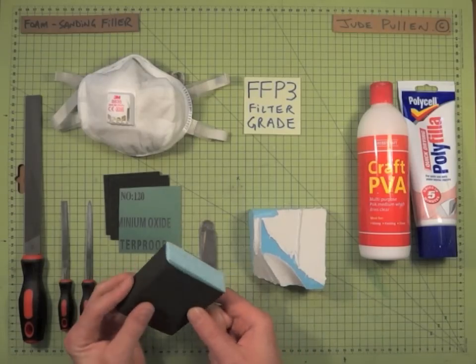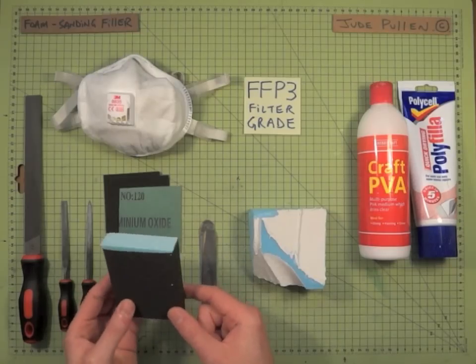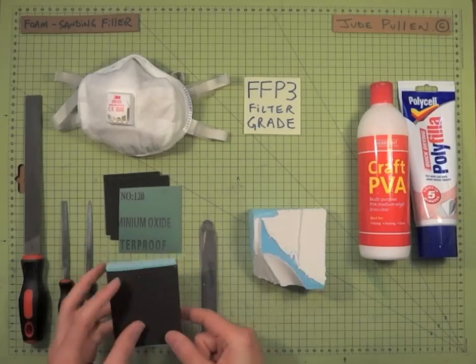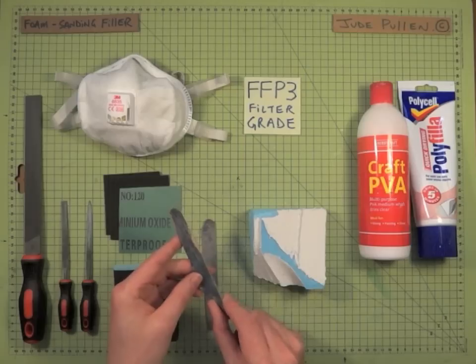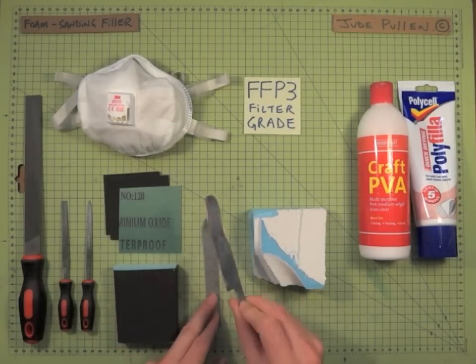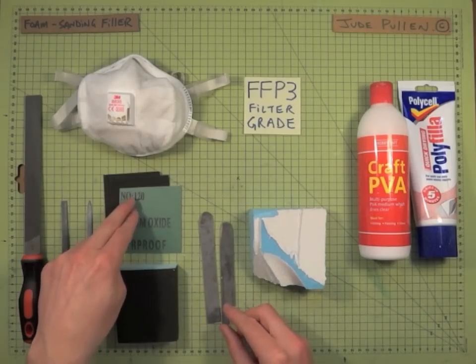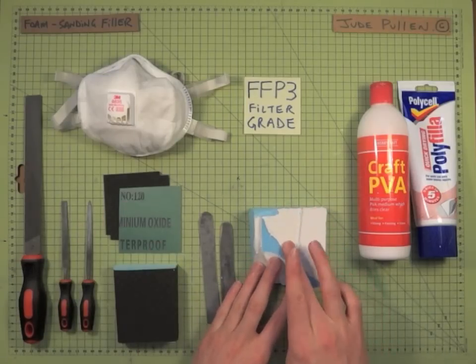Given that you'll probably have some styrofoam offcuts, it saves you buying one of those fancy sanding foam blocks — you can just make your own and tape it on the back. Homemade tools such as a lollipop stick or tongue depressor work well; this one has two different grades. This is a 120 grit, which is really coarse, and you can use that just for taking down the rough edge.